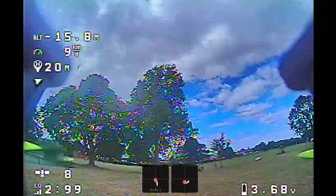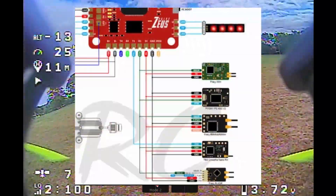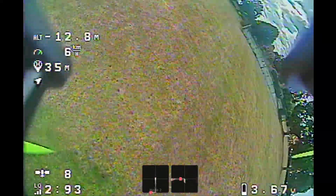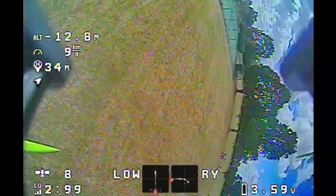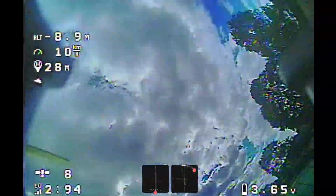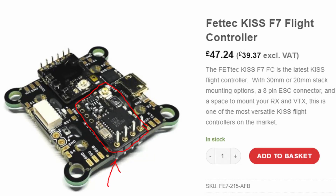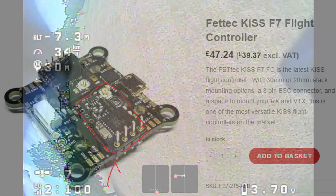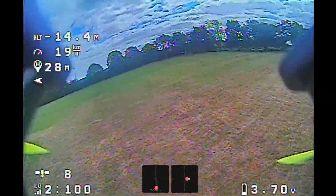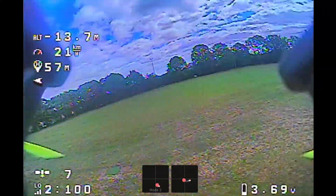It's got pads on the board where you can solder directly your receiver and also your VTX. If you have a TBS Unify or a small VTX, you can just solder directly onto it, which is really cool. You kind of see that on quite expensive flight controllers like the Fetech F7. It's nice to see that on a small, cheap board.